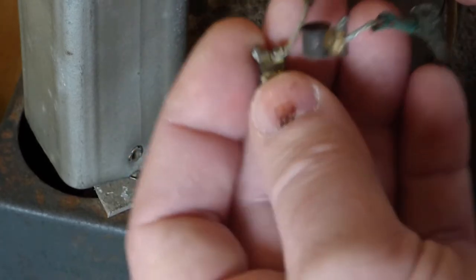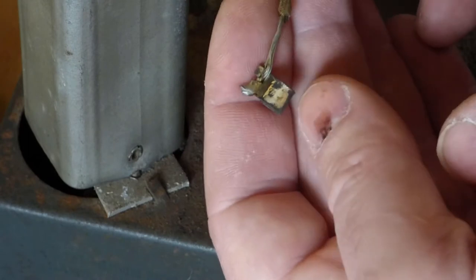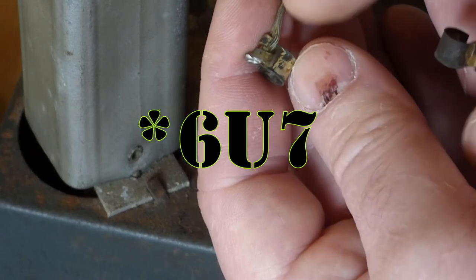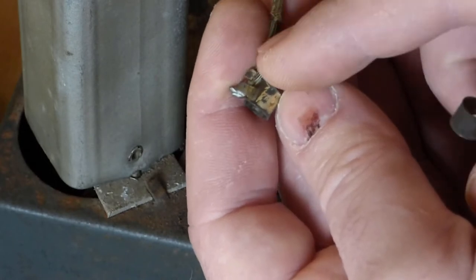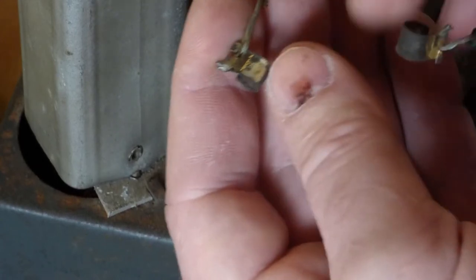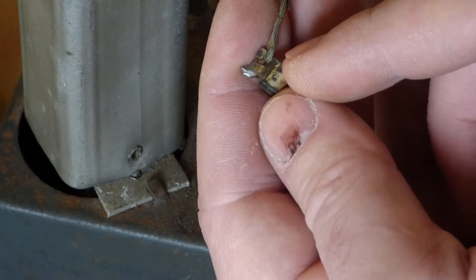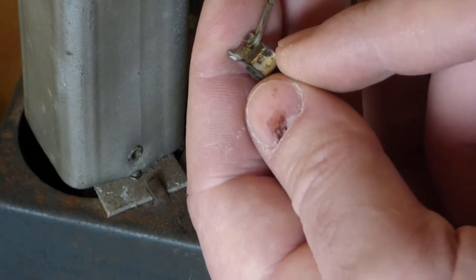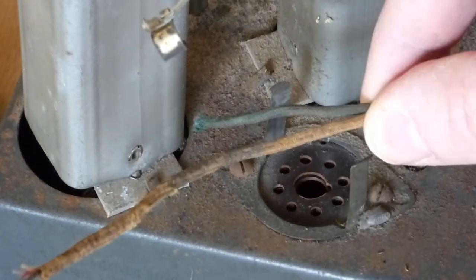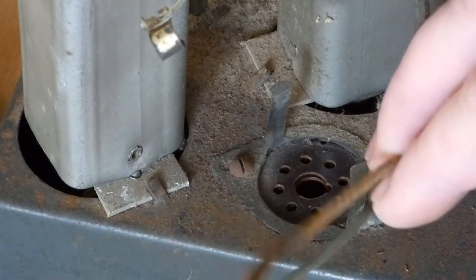This one is in a little bit worse shape. This is the one for the 6A8 and it's going to be a little bit more difficult. We could heat shrink it but the wire's broken — well, the insulation's broken in a couple of spots. The grid cap is the same so it should be easy enough to get off. I'll replace the wire and then put it back on — a new old piece of wire. I'll find something appropriate. In terms of the aerial and earth wires, same story — I do have some reproduction wire and I'll probably just put in a length of aerial wire, because these sets really need a good 30 metres or 100 feet of wire. Just having a metre or so on these sets makes a huge difference to their capability.